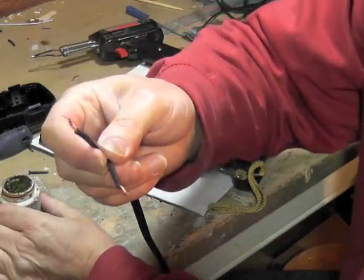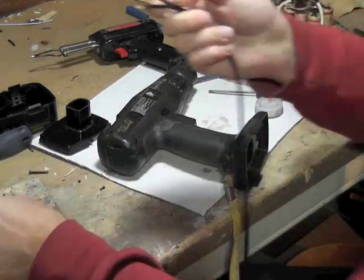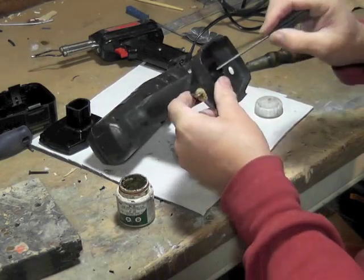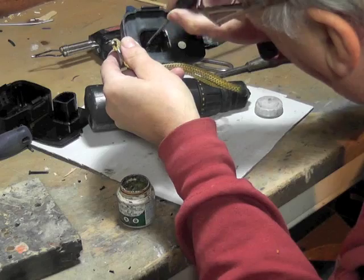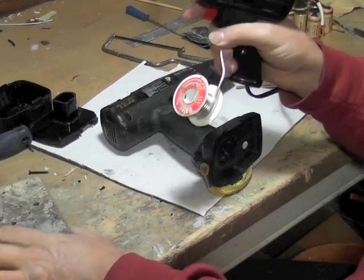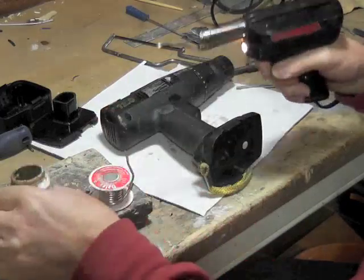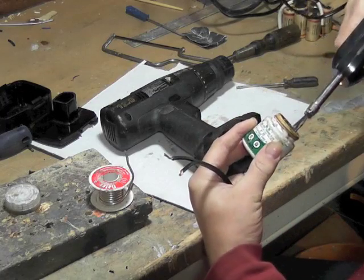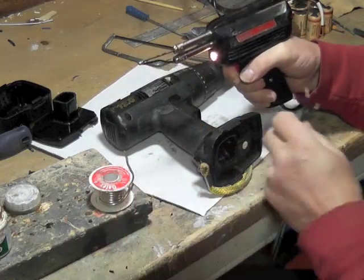Put a little bit of flux on the end of your wires - just dip them in the flux a little bit so that they have flux on them. Put that out of the way a minute. Then take a little screwdriver and put a little bit of flux in here on these contacts - the two silver contacts inside the drill. There we go. Now get your solder - bring this up a bit. Heat up your soldering gun. I usually stick it in my flux just to get it going. What you want to do is put solder on the wire, solder on the tabs, and then touch them together.